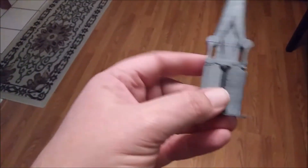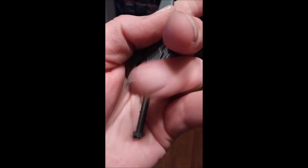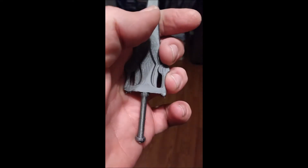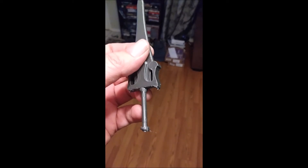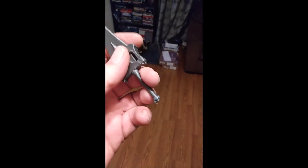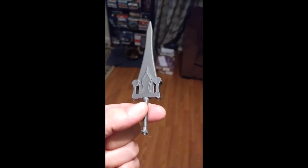Let me pop these supports off and see if we can see it on the print itself. I see where it might have been. Can you see this? See that right there around the handle, right where my pinky is? That's the only thing you can see from the power restore, and that is no big deal — that's just a little bit of booger that'll come right off. So, power panic on the Prusa i3 MK3 test: yanked out and off for almost two and a half hours, plugged back in, gave me the message that we experienced a blackout and asked if I wanted to recover — which I did — and it recovered nicely. You can see a little line, but you know how to sand, right? It'll sand right out. I am very impressed. We absolutely love our MK3. What do you guys think?